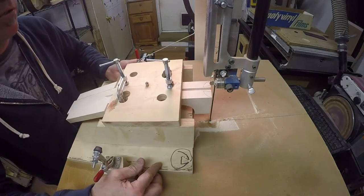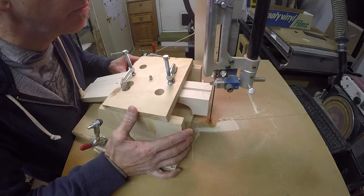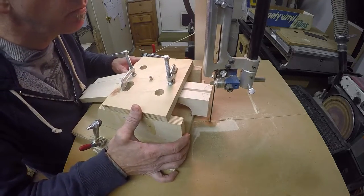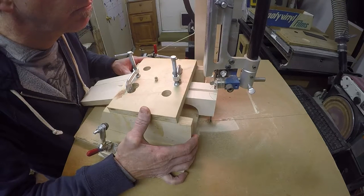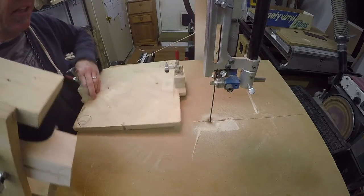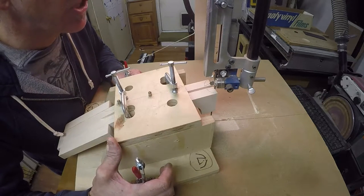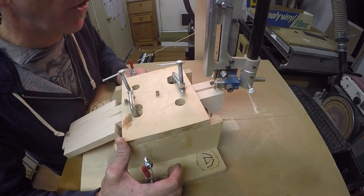This one says I'm cutting the left side, so we're going to cut the left side. I like to make these cuts on the pin right down the middle of the line. That takes out some of the extra wood, so it makes my initial fitting go a little bit faster, as it will drop down just a little bit further into the body.